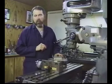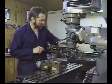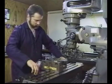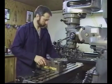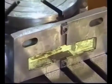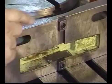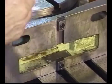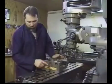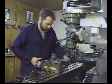I'm going to go ahead and flip it up into the vertical position so you can get a perspective again of the versatility involved in a rotary table. Remember we talked earlier about our spacers on the bottom of our mill vise. Well, the same thing has been done here on the rotary table, so we would simply invert this, line it up in the T-slot, pull it to one side where both of these rail edges align, and that's going to pretty well align it. So let's go ahead and give that a try.